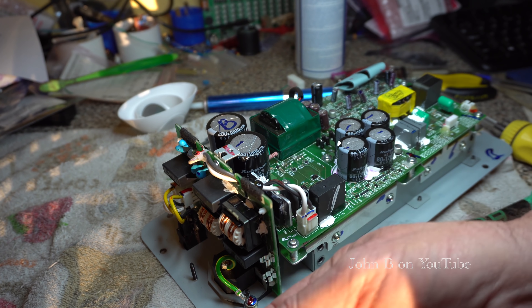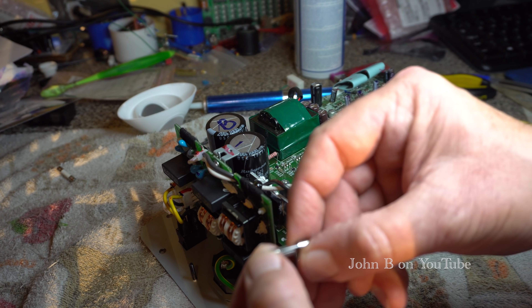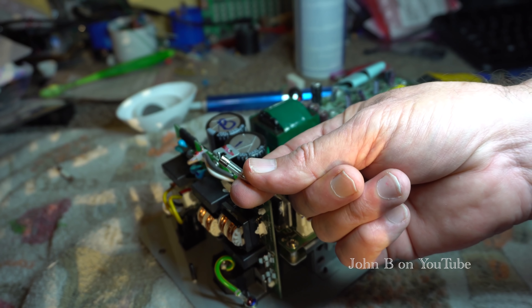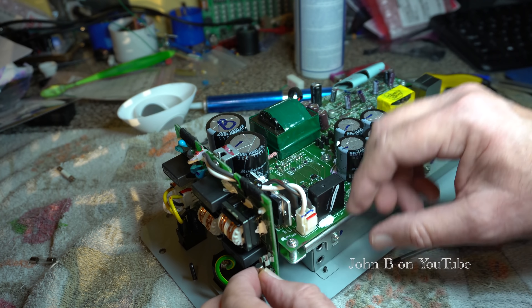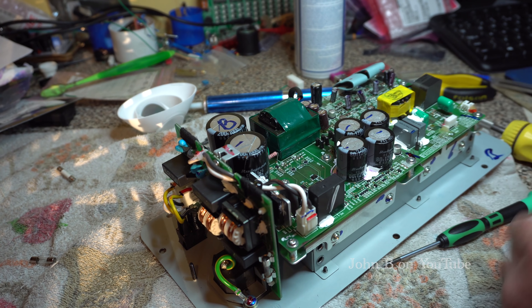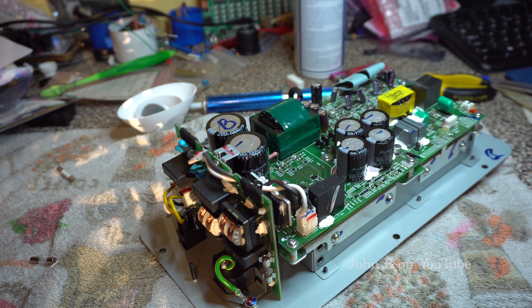So I'm going to look for a 3 amp. I found a couple of fuses. If it's going to go bang, it's going to go bang with a 3 amp. So I've got a 3.15 amp anti-surge — that's what a 1000 watt Mackie has. And this is a 2.5 amp, so I'm going to put this one in. I think it's a quick blow, but 1000 watts when driven full volume — we're not going to be drawing much current here, maybe an amp to start up. This 10 ohm inrush limiter will limit the initial rush. So let's get this mains lead.